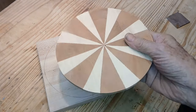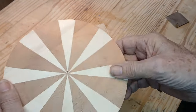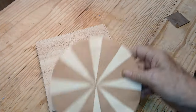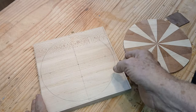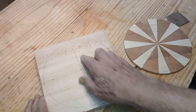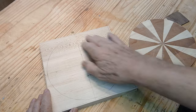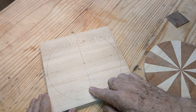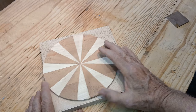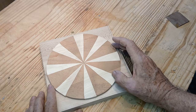I've got that glued together — the two halves glued together. I've sanded it, cleaned it up, got it looking pretty good. The next step: I found the center of that, which already had those guidelines on there. I drew a circle the same size as this — 7 and a half inches approximately — to match it. I'm going to cut this out straight up and down and glue this to it using my bowl press, put it together in there, and let it sit overnight. I'm late in the day here, so that's going to work out just right.